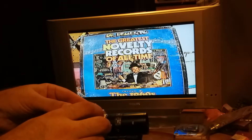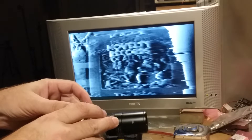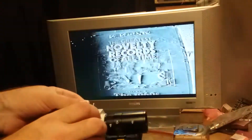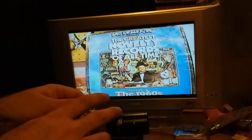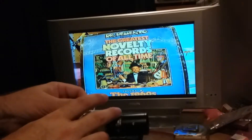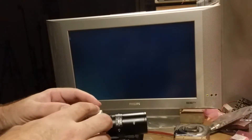This is the reset gate and the first horizontal clock shorted — and here we have another cool kind of horizontal blur. If we dial it back you can kind of make out the original image and mess around. That's killer. And on the other side of that is this kind of finicky one — sometimes it works really good, sometimes it doesn't. There's probably automatic gain control or something involved, but it's kind of a saturation effect. This is a fun one to stack; you get these gnarly contrasted washed-out looks. Really nice.